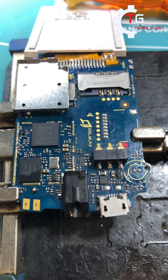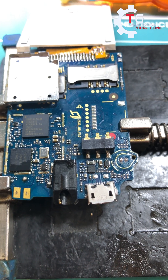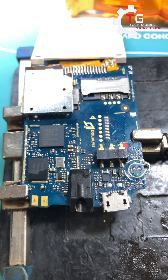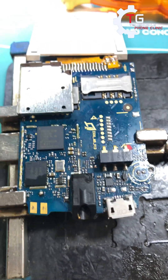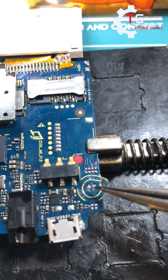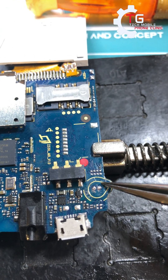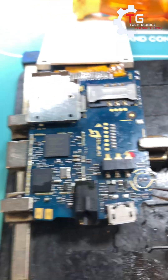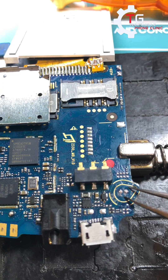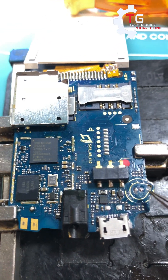Hello guys, this is my phone clinic. This is a Alcatel A1410 that is having a mouthpiece issue. You can see the mounted mouthpiece connector that was there — we've removed it and changed it to a normal mouthpiece, but still the mouthpiece wasn't working.